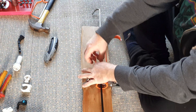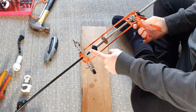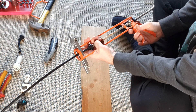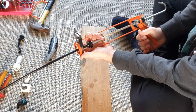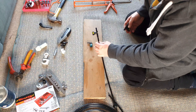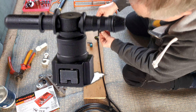Hold the fitting into place, take up the slack, making sure that your pipe and all the fittings are absolutely square and in line. Use your opposite hand to keep them that way — because this is a cheap gun it's quite flexible. Squeeze the trigger, which you might have to do two or three times, and hey presto, the pipe fitting is in.